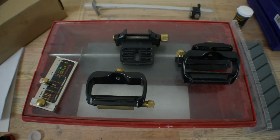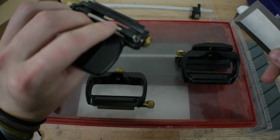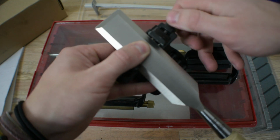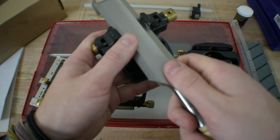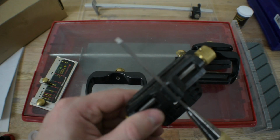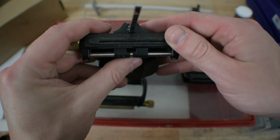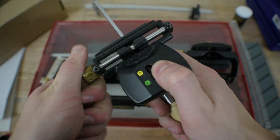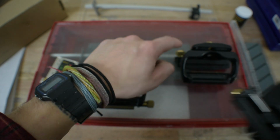So, just to kind of show you how this works, I've got my chisel that needs it here. This is a 1.25 inch chisel. And all you've got to do is lock it down, and it can accept that, as well as all the way down to an 1/8 inch chisel. And the way that it works is it is self-centering. That way there's no way that this can be twisted or anything like that. And so I will show you how to set the degrees on this guy.